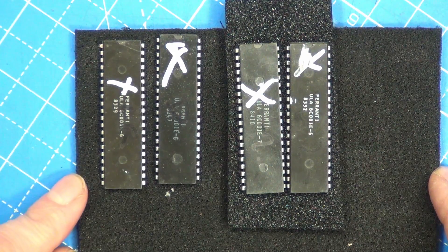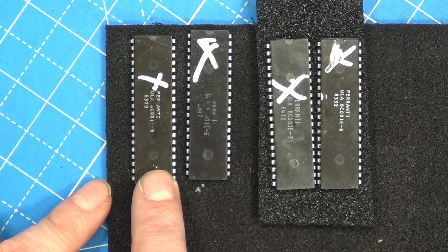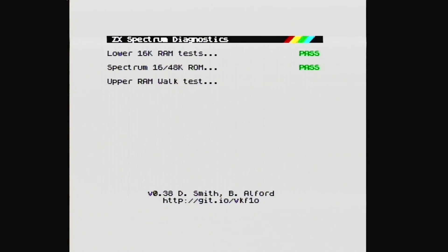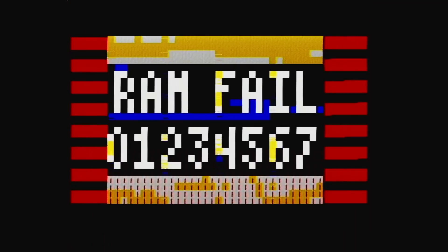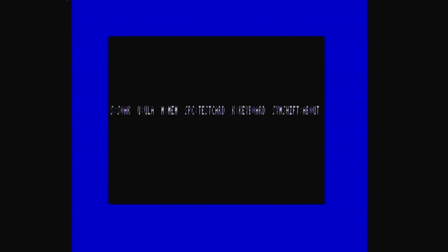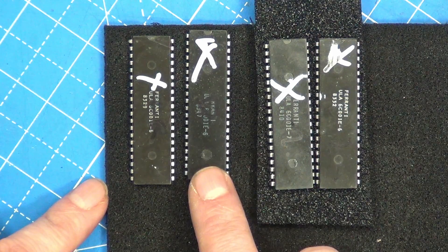Now we're going to look at these four ULAs that a friend sent me, and they were all marked with an X — he believed that they were all faulty. So we're going to run them through the 0.38 tests. The first one I've labelled as lower RAM. The first time that we run it through the test, it appears to be OK. But then as we get towards the end of the first batch, we start to see corruptions on the screen. Then when I run the test for the second time, everything just gets worse and worse, and eventually we get lower RAM failures and all of the RAM fails. So I wonder if this one is a heat-related problem, but it was very unstable. The second one was dead and we got nothing, so we'll just move on.